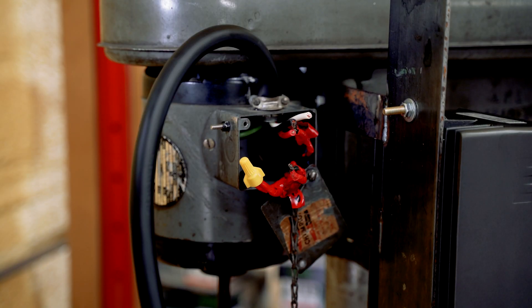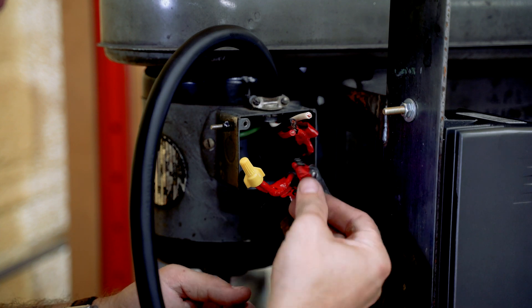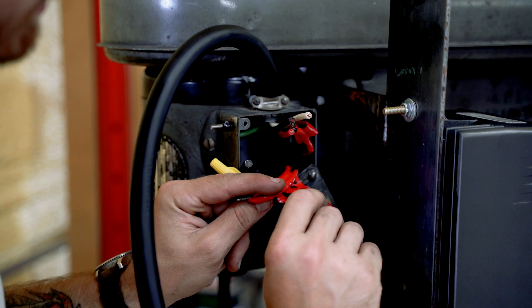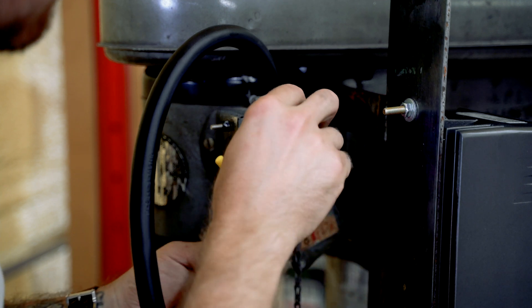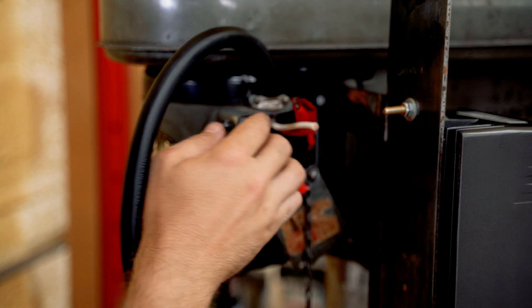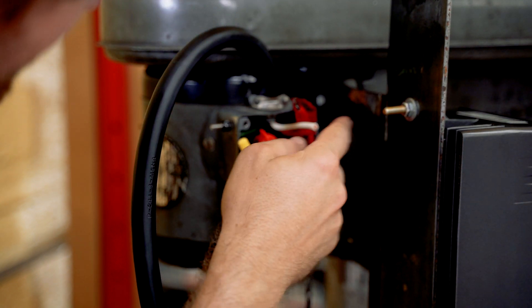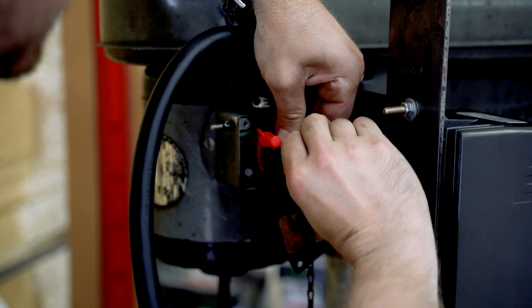T1 and T7 should be L1. In my case I'm going to follow what the wires are marked — my L1 is this black wire. I've got L1 wired. Now I'm looking for T8 and T2.